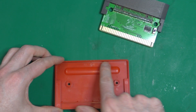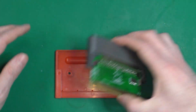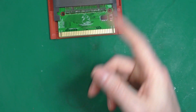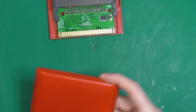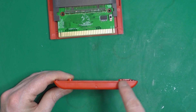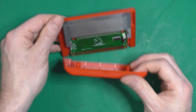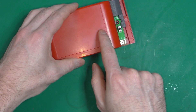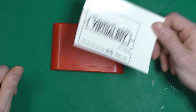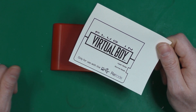To prevent further bending from pushing and removing — because you try to wiggle it to make sure it's a straight insertion — I made a 3D printed part where the PCB slides in so you're sure it's straight and not wiggling. When you assemble everything you get the adapter with the switch, put it into the 3D printed sled, and then you can insert it. Of course you just have to remove some plastic and the 3D part already has the shape to fit it really flat.